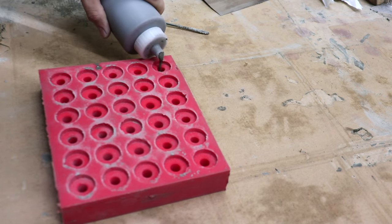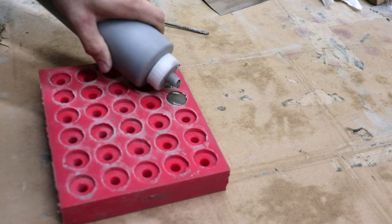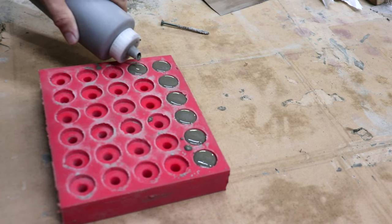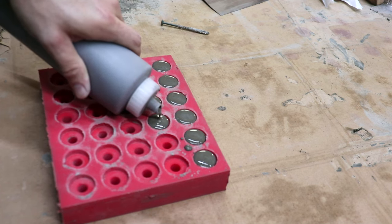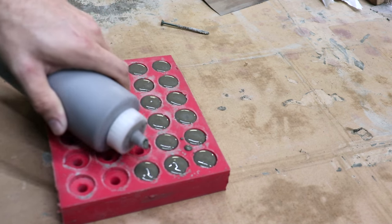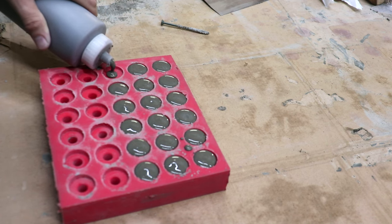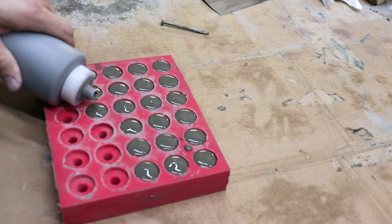And the molds that I have here, I made the molds. I didn't do a video on the mold making, but if you guys did want to try this, I will leave an affiliate link down in the description below to where you can buy the silicone to make the molds. It was a very easy process. And I started out sand casting, making molds out of sand and pouring the concrete into that. And I was not happy with the quality of the plugs and the tiles. They had a lot of sand stuck to them and they were misshapen. So that's why I switched to the silicone molds, and it cuts down on the time and the effort tremendously.